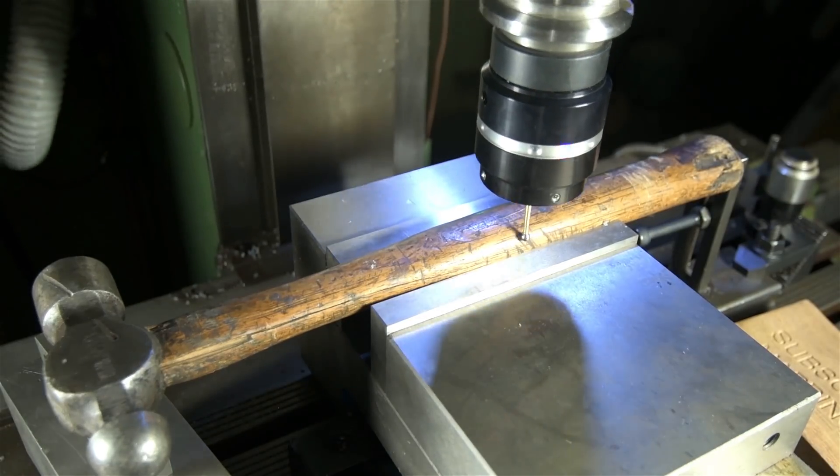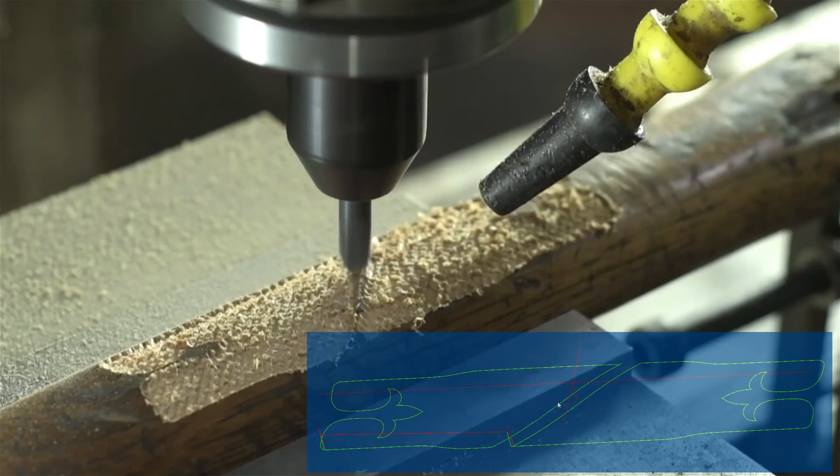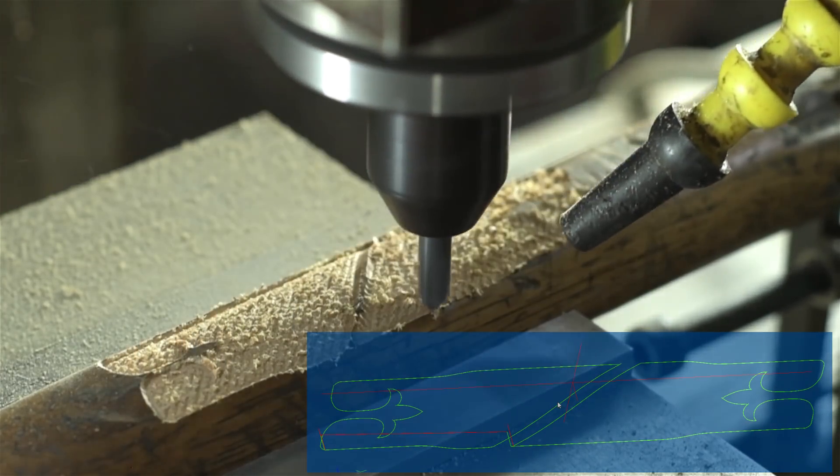As before, notice they're 2D — they're flat. No fancy surfacing to get them onto the hammer handle. And just like we did in the last video, set up your workpiece and map the area you're interested in cutting. Then just run your 2D G-code. And that's it — pretty darn fast.